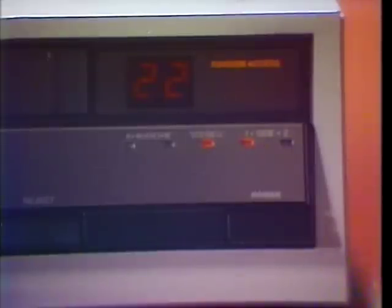This digital display on the 400's front indicates elapsed playtime in minutes. It also displays a P when the player is in pause, L for load disc, UL for unload, and E for end of disc side. And A will be displayed when the player's antenna signal has been transferred via the remote control unit.